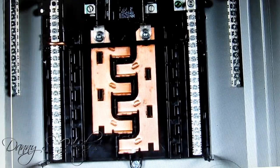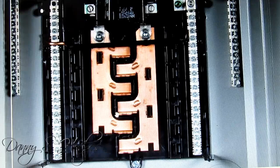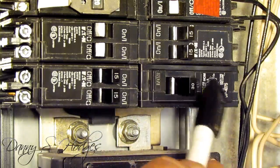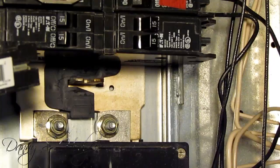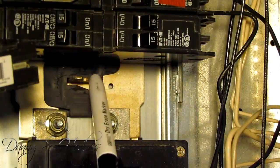It's just as simple as putting all your breakers on this one side right here — the B side. They can be across from one another, because this side and this side will both be on the same prong right here. This right here is where my generator wire will be coming in, and this is on the B. I'm going to pull that out and show you it sharing the prong. You see this prong right here? Both of these breakers are sharing that B prong right there.